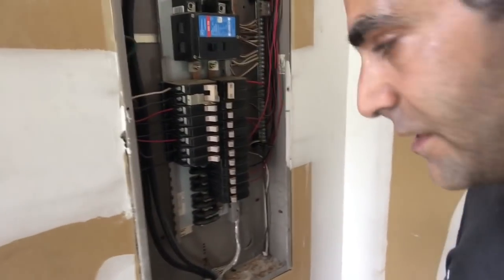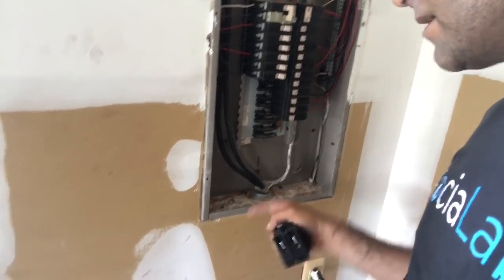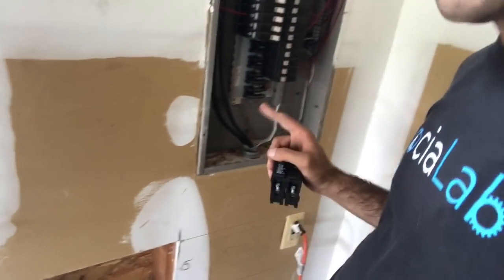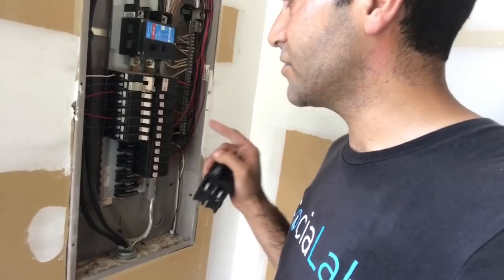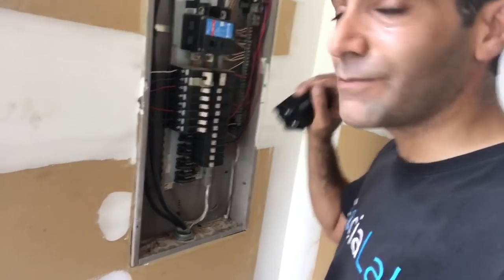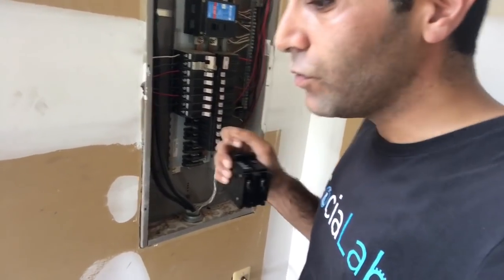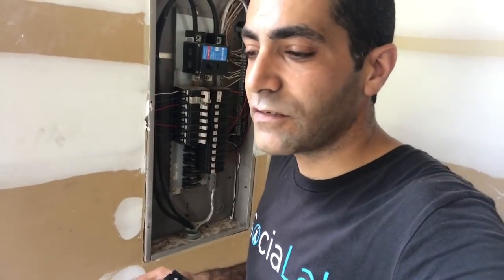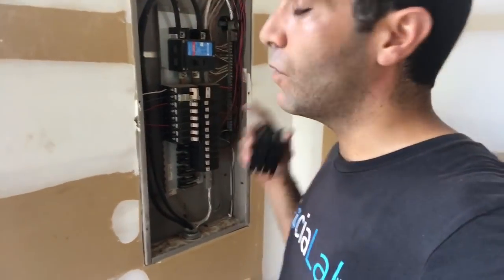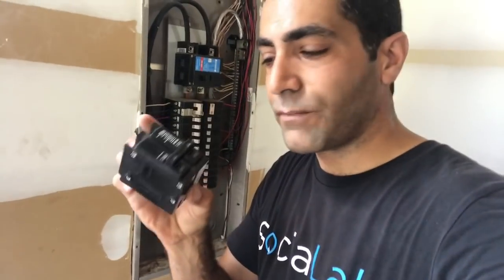I took the cover off the breaker panel and this is exactly as I had hoped it was going to look. I was going to drop the 50 amp breaker right here in this area, punch through the bottom, and run the wire down and over. Now - please, please do not touch anything in here while the main breaker is still on. Every one of these hot wires is live. Even if a tool in your hand, or a kid running around with something metal, goes into this panel, people are gonna be in trouble. Make sure you've got that breaker off.